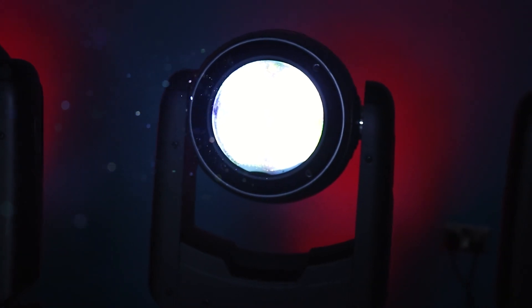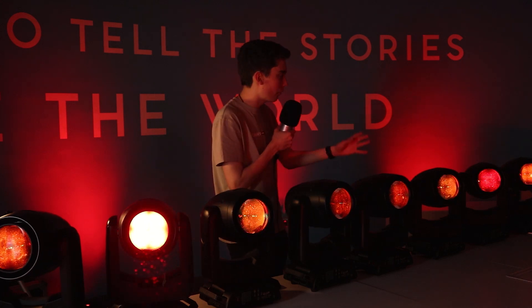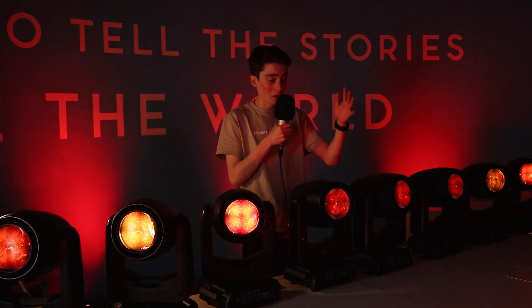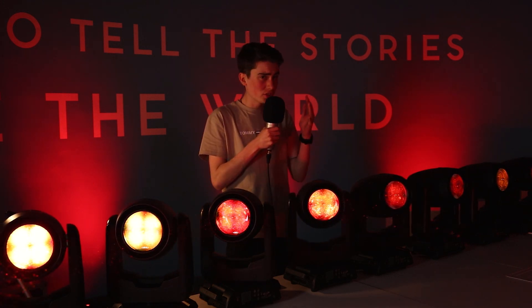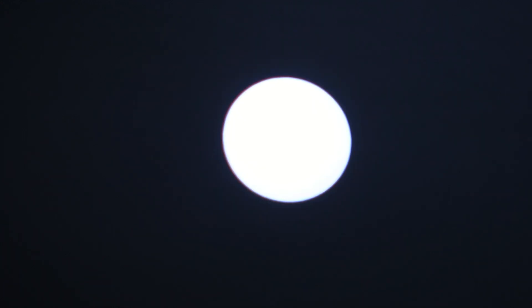The Darts has a tight three-degree beam. It's a very punchy beam and I do like it — it's a great beam fixture. I really want to use this with a DJ client of mine who came to the office recently and absolutely loved these lights face to face. It's also got a motorised focus including 14 static gobos. It's also got two prisms: a six linear prism and an eight facet independent prism.